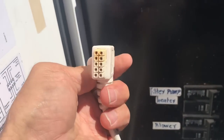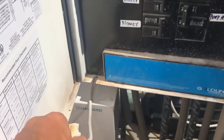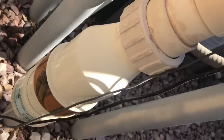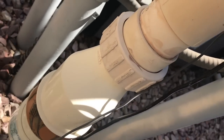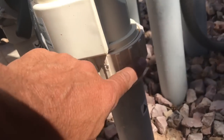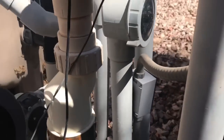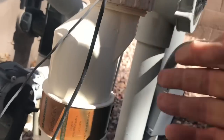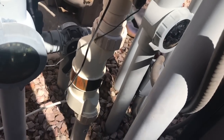See how it says 'cell'? This is the plug. You've got to be careful not to break it or get it wet. I'm going to take that cord off — it's attached to the cell. There are some wires here so I've got to be careful not to hurt those when I loosen it. I'm going to unscrew the top nut and the bottom nut on the cell to start the service process. My system's not going to come on — I've disconnected it. I'm going to use the channel locks to loosen it and will turn the video off for just a moment to get that done.